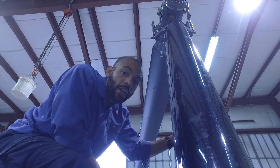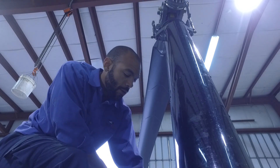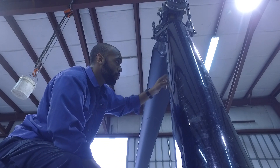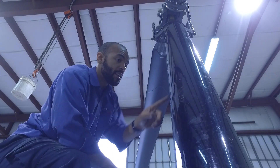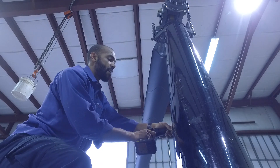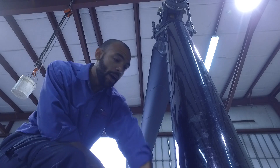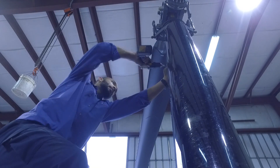Another tip when you're working on the mast fairing: remove your top screws, remove your bottom screws, so that way you just have the trailing edge and the middle screws. Then slowly remove the trailing edge screws on the top and bottom until really just these middle screws are holding it, so that as you remove those screws, the sail pulls back slowly. I'll show you what I mean. I have the tops removed and the bottoms removed, so I'm going to begin removing the trailing edge screws.